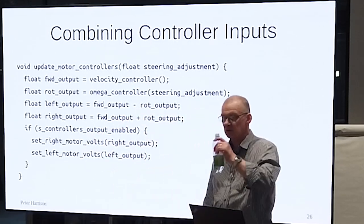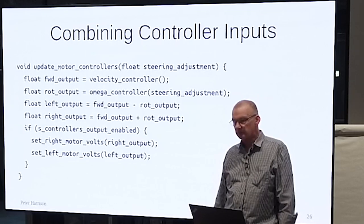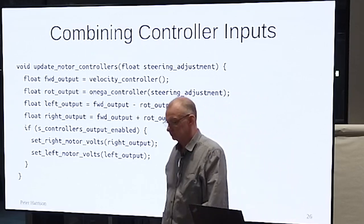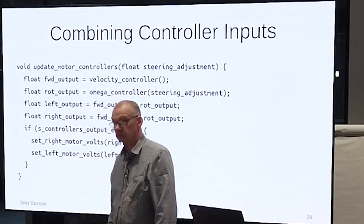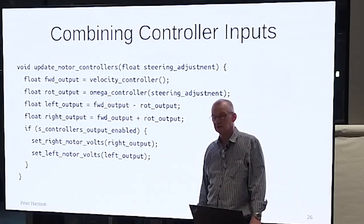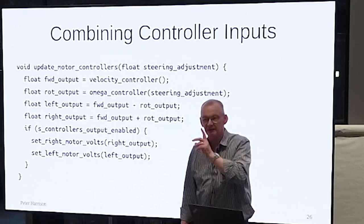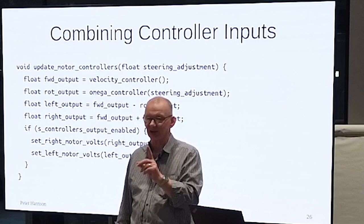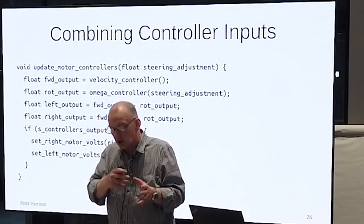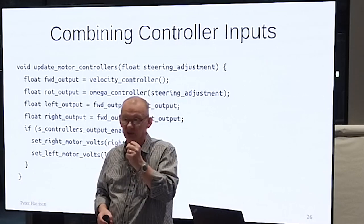In a line follower, with a Minos, when you're going down a straight, I assume you should be going for an angular velocity of zero. Yes. With a line follower, what should you be aiming for? Angular velocity of zero. Just leave it at zero. Well, that's the thing, right? Whilst you are just following the line first time round, set your controller angular velocity to be zero.